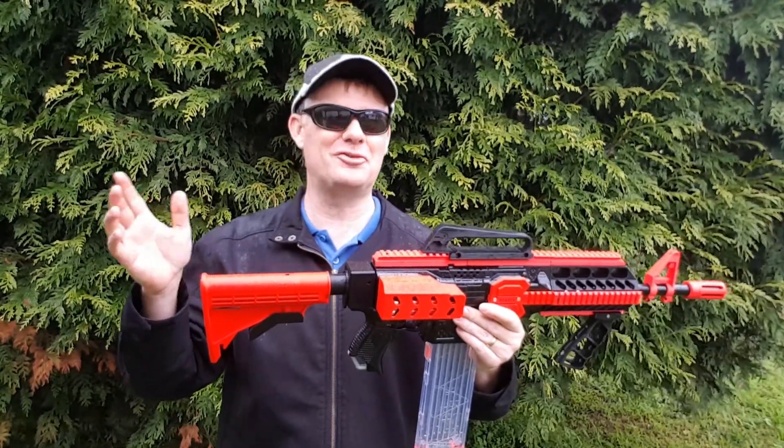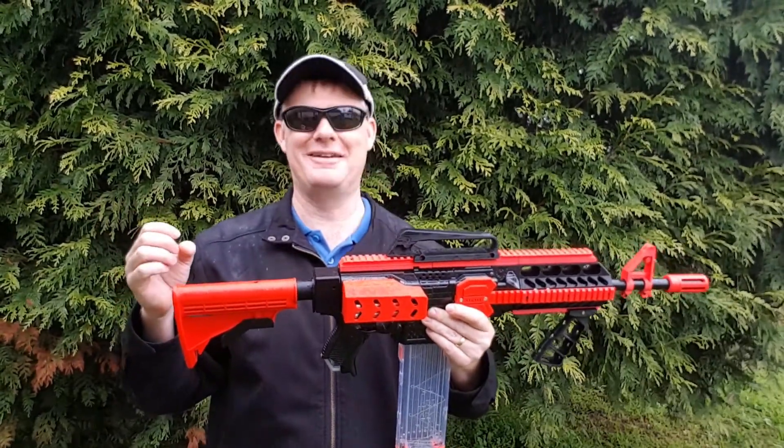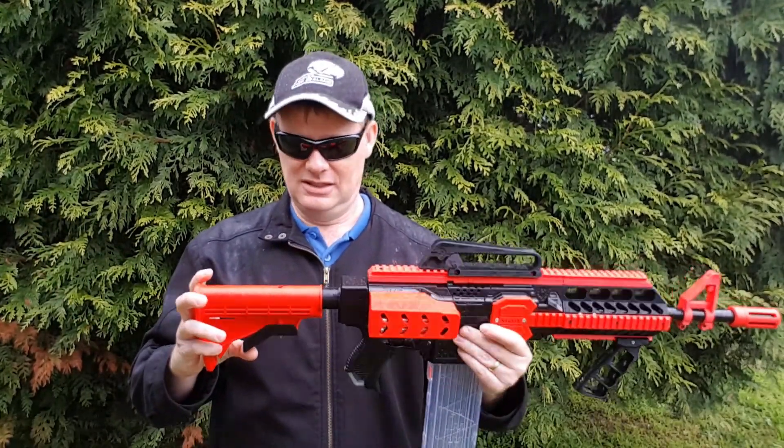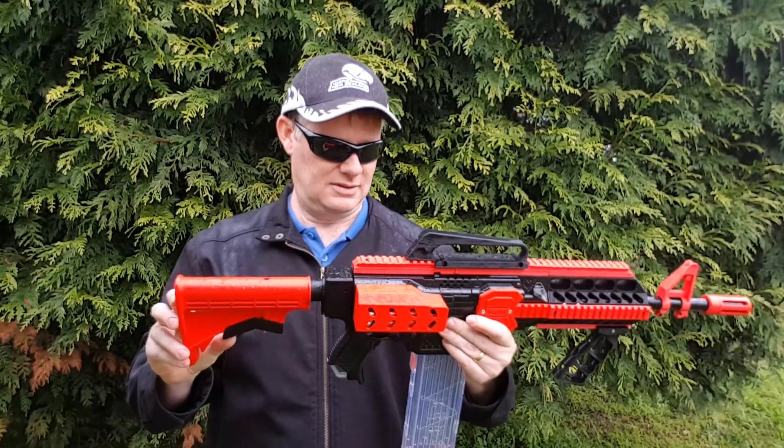I've made this in a few different sizes. There's nothing worse than spending 24 hours making parts that don't fit together - that's partly because of different print calibrations. If you're under-extruded or over-extruded, or have stringing problems, things won't fit together. So there are two versions - print the test print first, try it, and if it doesn't fit try the fatter one.